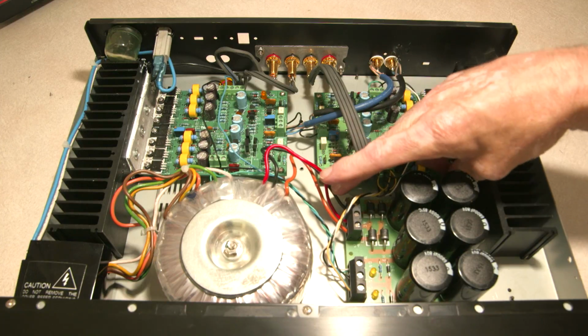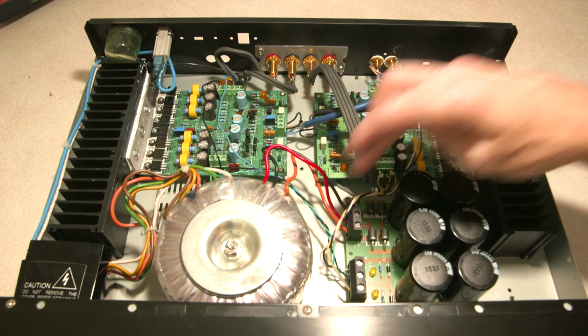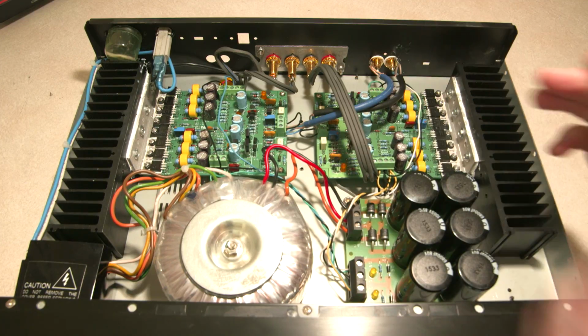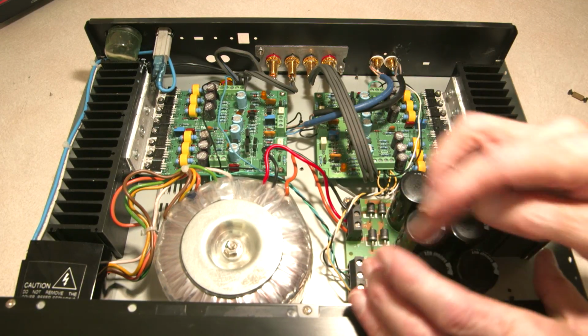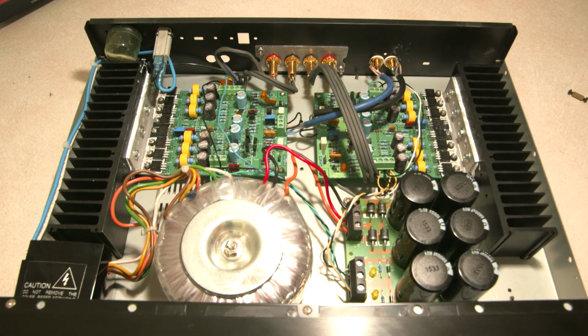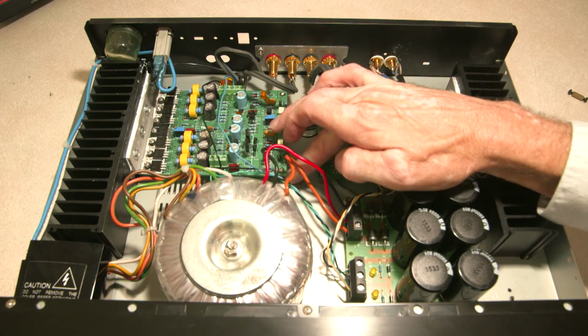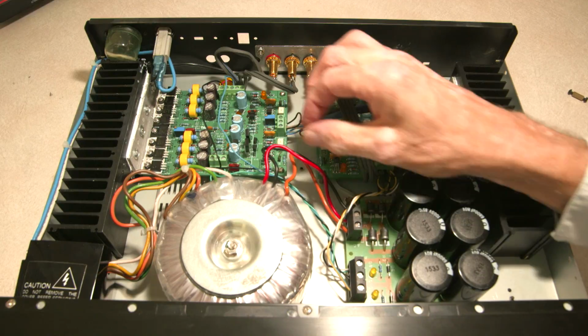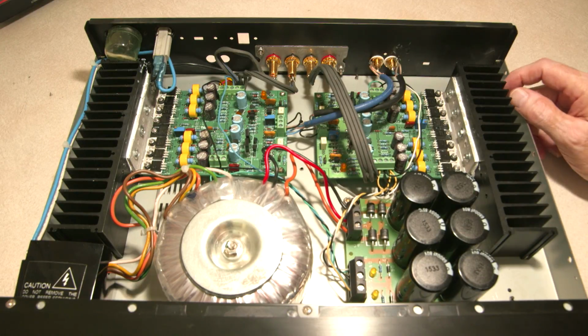And especially here, the power supply, I probably needed to make a template for the power supply. I made just a hard card with the holes precisely located, and then put the hard card down here and use a punch or whatever. And I should have spent some more time on that in any case. The final solution, though, is the holes in the chassis can be drilled a bit large, and then those can move around a little bit, so there's a little bit of flexibility.